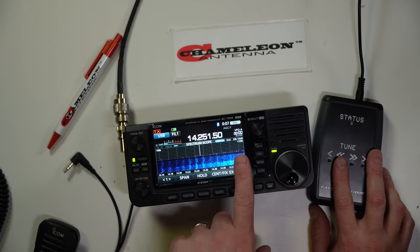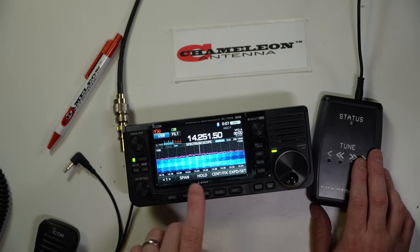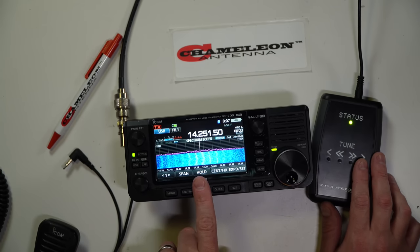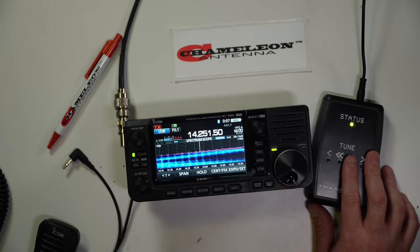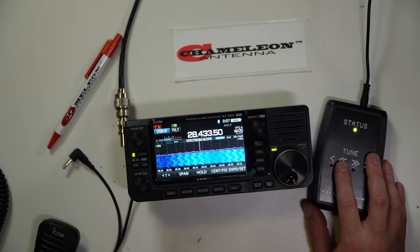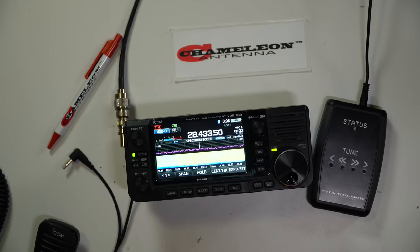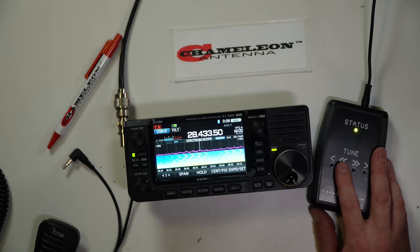I can see the noise just moved away. We've got a 100 kHz span here. Let's drive it back in. Now I'm in the garage with an awful lot of noise, so you're going to see that even more prominently displayed here, but it makes for an easy demonstration. Those are the gross movements. Let's do the fine tuning — you can see it slightly starts to shift with the fine tuning, really, really fine. And if we want to slide quickly, we can go through just like that. Let's change bands to 10 meters. Comes in — look at that for noise. By clicking the gross movement just a bit, we're already out of tune.